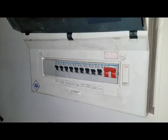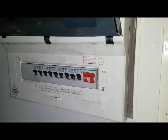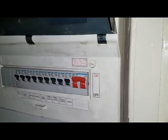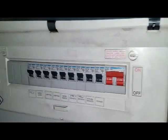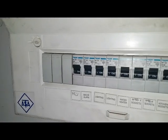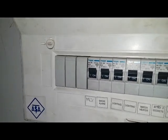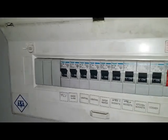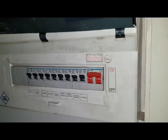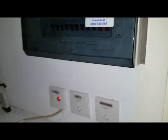Incidentally, if you've got switches like this, some installations do have a timer on the consumer unit, so you can look on your consumer unit to see if there's a built-in timer. If there was one, it would be here where those three blanks are, but it's not fitted. This is why we're going to fit an external timer onto this installation.